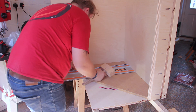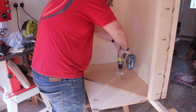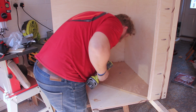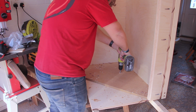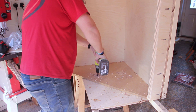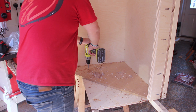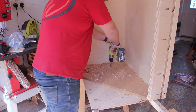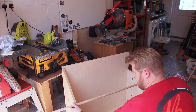I set a punch and then used a 20mm bit for some of it to cut out the holes. The diameter I actually needed was 22mm because that's the size of the rod I had, but I couldn't find a 22mm forstner bit so I used what I had. It was really important to get the holes to match on either side, and I didn't trust my measuring skills, so I put the other side of the board underneath while drilling — that way it went through into the corresponding piece and I knew where both sets of holes would be.